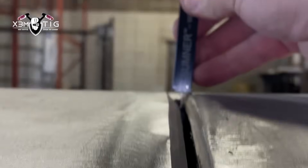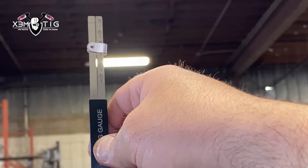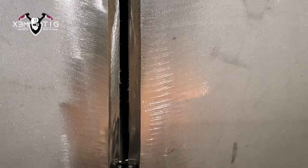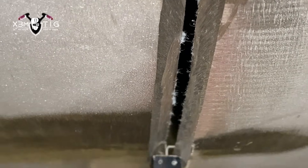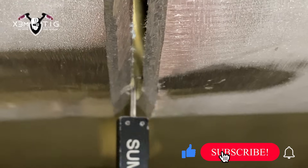We got to chase the bubble — you're not going to get rid of it completely. Just going to show you with a high-low gauge: good on the top, pretty much good on the side, and the bubble is going to be on the bottom. The good thing is I'm not going to weld this in position overhead — we're going to roll it a quarter. There's other pipes here on the pipe stand, so as you can see there's almost a quarter inch.